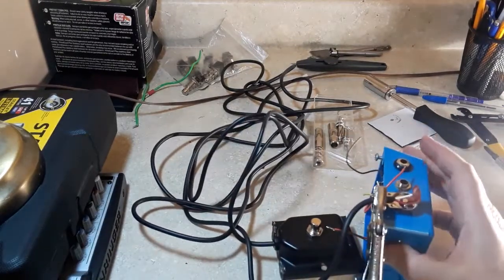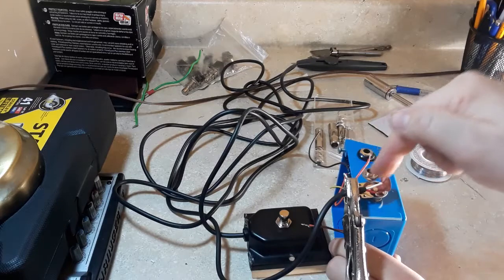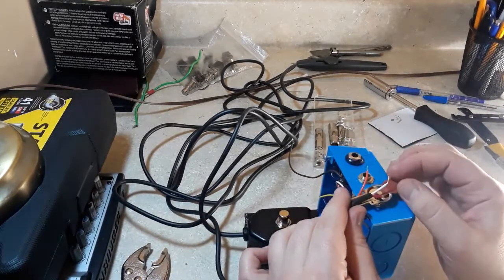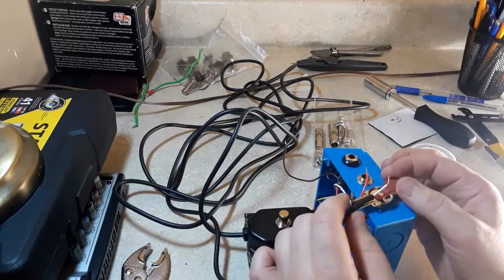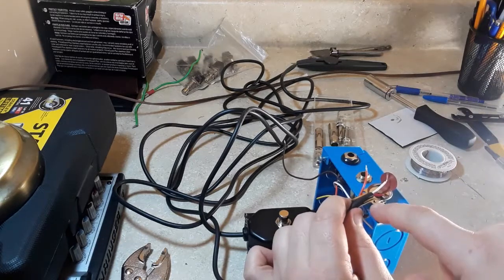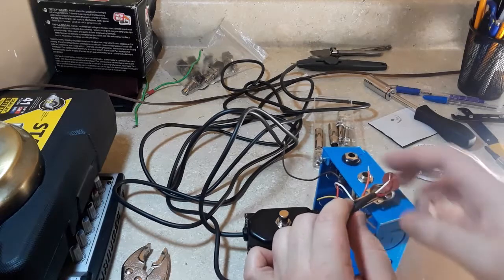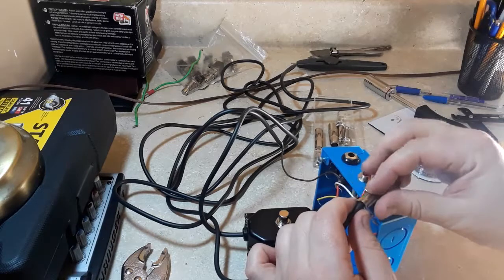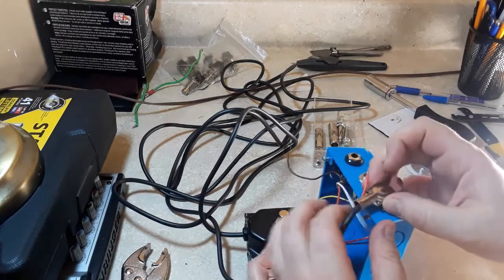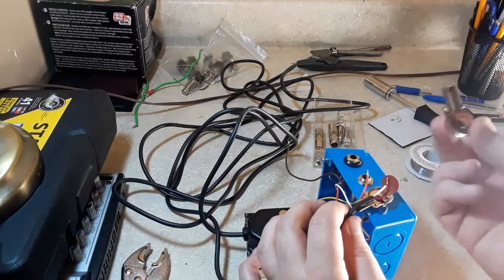You can see just how big of a pain this thing is to solder. I've got it in a fixture here, then you have to hold this wire in there and try to hold it in place. This is just not fun. Now I've got to figure out where to solder this — I think you're supposed to solder it to the case, or maybe this is made for an instrument cable where you just fold everything over and tie it down. I'm going to try to put it next to one of these holes and hopefully get a good ground through the mechanics there, and maybe wick in some solder when I'm done. There's not really a lot of strain relief in here — I probably have to build that up with some electrical tape so it'll hold. I don't like these old Fender-style plugs at all.